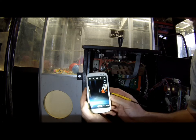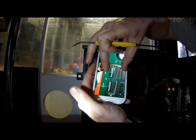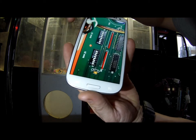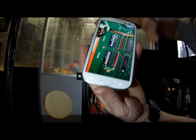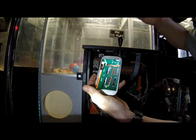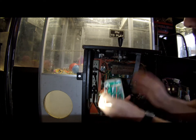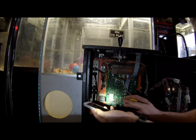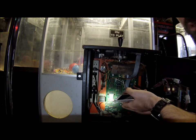I just took a picture of the circuit board. I can see bank one and bank two, and I can see where all the switches are at. That's the first thing you do — take a picture of the DIP switches so you know what position they need to be in for the machine to stay where it's at right now. Once you start adjusting things, you know how to put it back and get it to at least operate the way it was before.